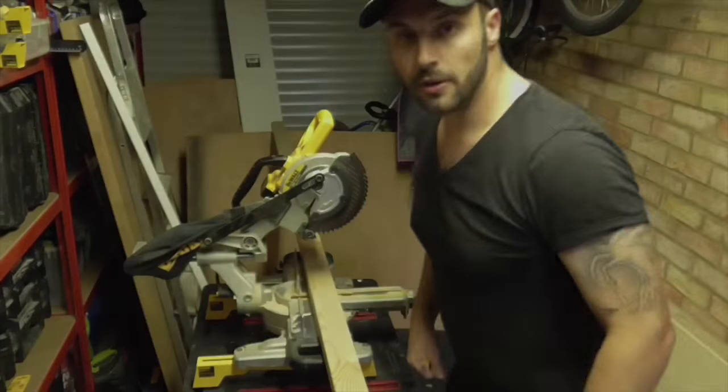I've got the plate on the wall. I'm going to use a hinge — it's called a piano hinge. I got it on eBay for £15. It gives you a hinge for the full length of the worktop. It's pretty sturdy and strong — you can get different colours and I went for the silver option. It's about 5cm too long so I'm going to cut it down with a hacksaw. I always use a Sharpie or permanent marker to mark cuts on stuff other than wood so you can see it clearly. It needs to be just under 1.8m.